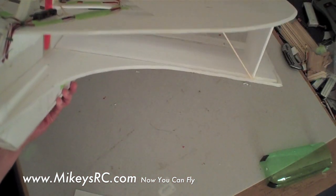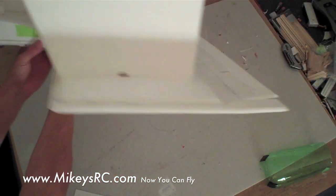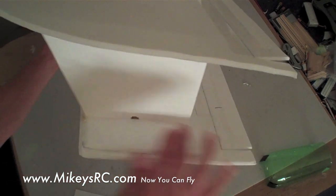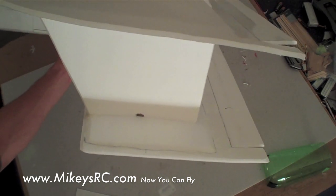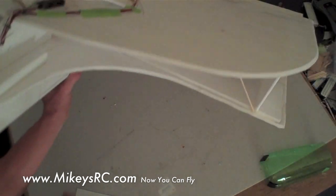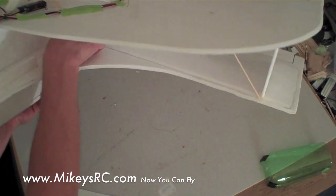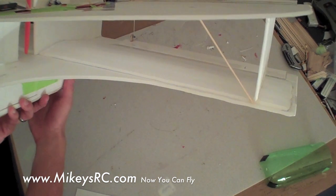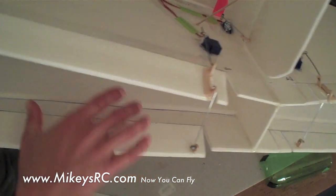The next thing after the wing spar is to cover the lower wings with the top sheet of foam. These are basically big rectangles of foam that go over the wing spar, giving it a nice airfoil shape rather than just a flat piece of foam — adding a little strength and lift. First lay a bead of glue on the leading edge underneath that foam and glue it down, putting glue on top of the spar at the same time. After that cures, glue the back edge down and hold it until it cools.